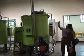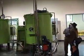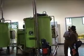The liquor is pumped into this tank, and from here we can send it to a variety of places in the factory. All of the stainless steel pipes are jacketed pipes. So there's a center pipe that carries the chocolate. The space between the walls of the inner and the outer pipe is filled with water, and we keep it about 140 degrees. So all the stainless steel is where chocolate's moving through. That's how we move it around the factory. Copper pipes are carrying water to and fro.